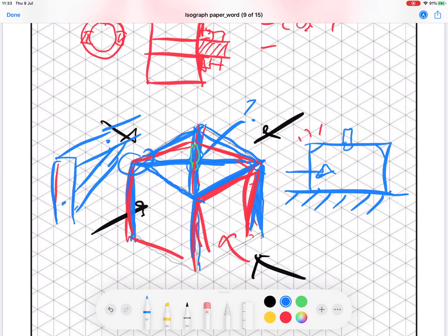Now, if you look at the 2D diagram here, you've created a cross brace here, which is absolutely fine. But there's a lot of force and stress going through that, especially if you look at lateral forces going through it. What you can do is, instead of having this sort of design going into the beam, you could have perhaps your cross braces like this.